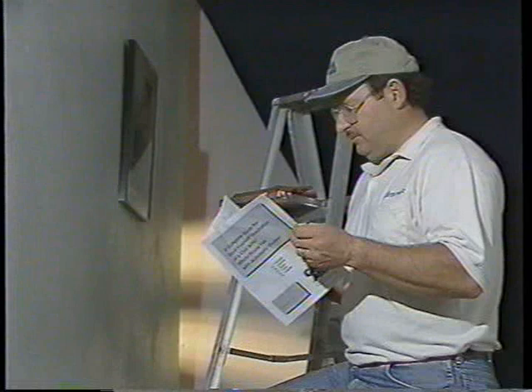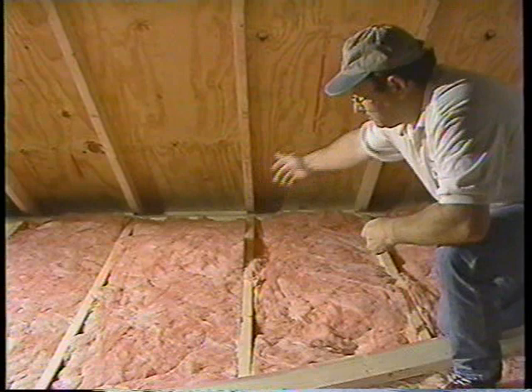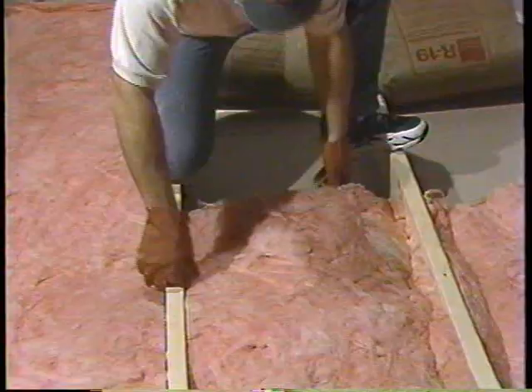Always install the shutter horizontally. Study the chart or the one in your installation manual — they are the same. Select your fan model and note the corresponding shutter opening size. Before making any marks or drilling any holes, take the time to be sure the shutter is mounted centrally in the hall. The joist may not be located in the proper place, so check your ceiling location in relation to the joist position before making any marks or drilling any hole.